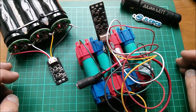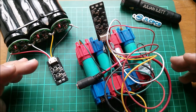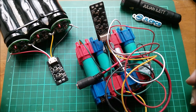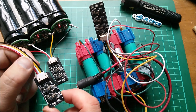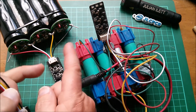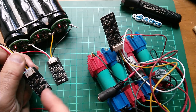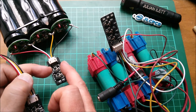Good afternoon. Active cell balancers like this three-cell one and this four-cell one — can they be paralleled up? If I want to build a big lithium-ion battery pack, I might want to shovel more current between cells than one of these can actually move. I've got a spare three-cell balancer, so I'm going to put it in parallel with this one on the super caps. I'll stick a charge current source on there and see what these do — whether they work together, oscillate, or fight each other.